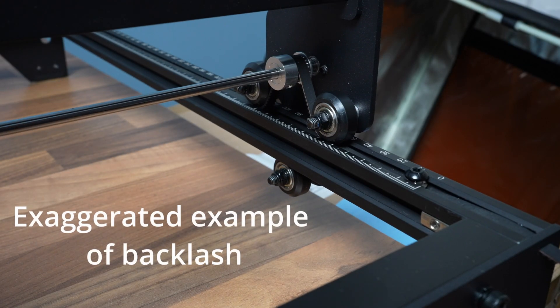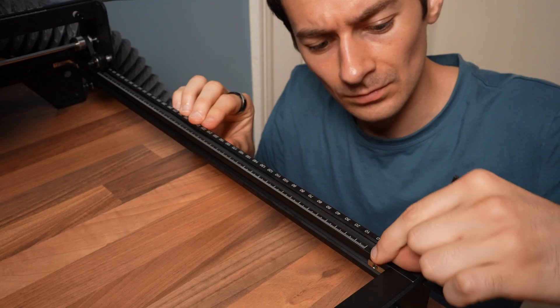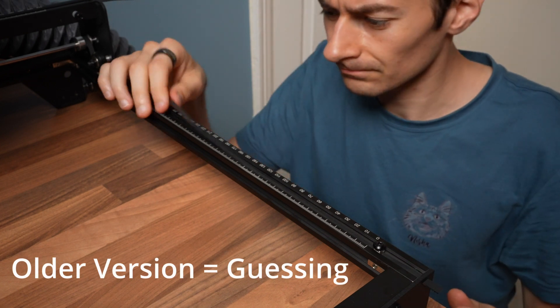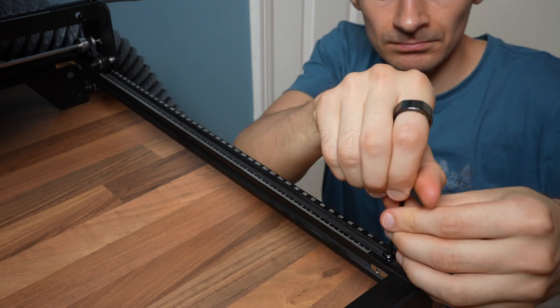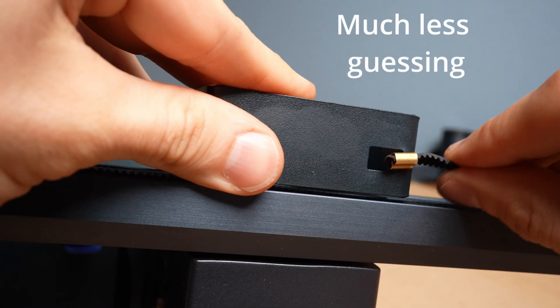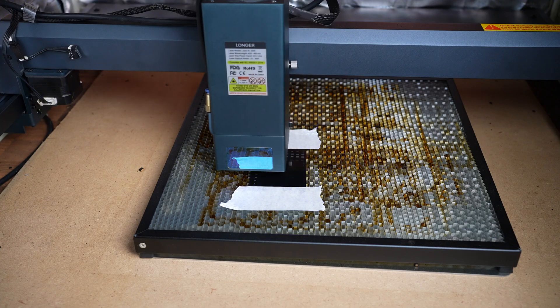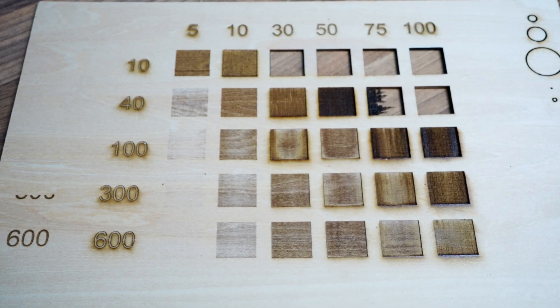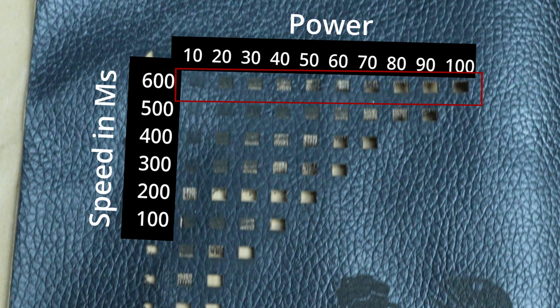Keep in mind that normally with a lot of speed you get backlash from your belt systems. But one of my favorite upgrades on this machine helps manage this backlash. In the older xTool A5, the belt system required the user to make the right judgment and guessing to get the belt to the perfect length. But with this model it's all arranged for you — you just slot the cable through two areas and it's ready to go. As a result you get a double-layer belt instead of a single one, which reduces backlash. Here are some tests done on different materials — even at max speeds engraving wood it goes pretty deep, and the same applies to leather and aluminum.